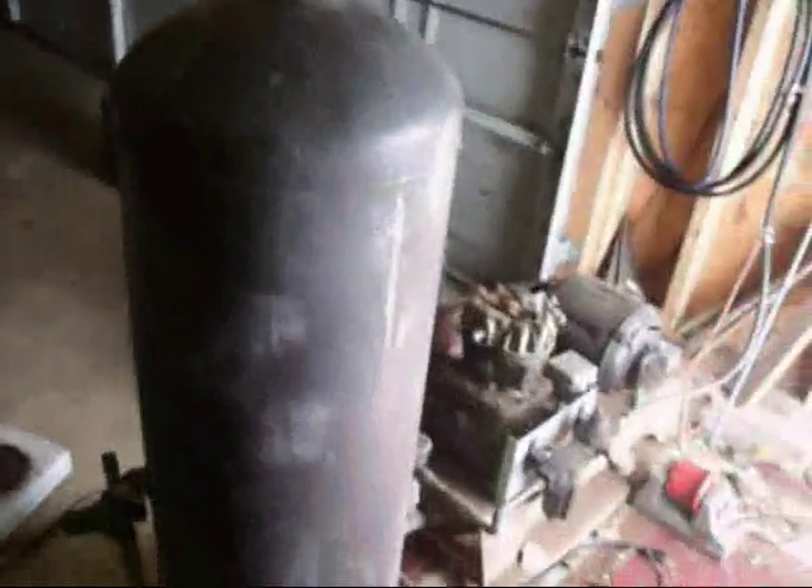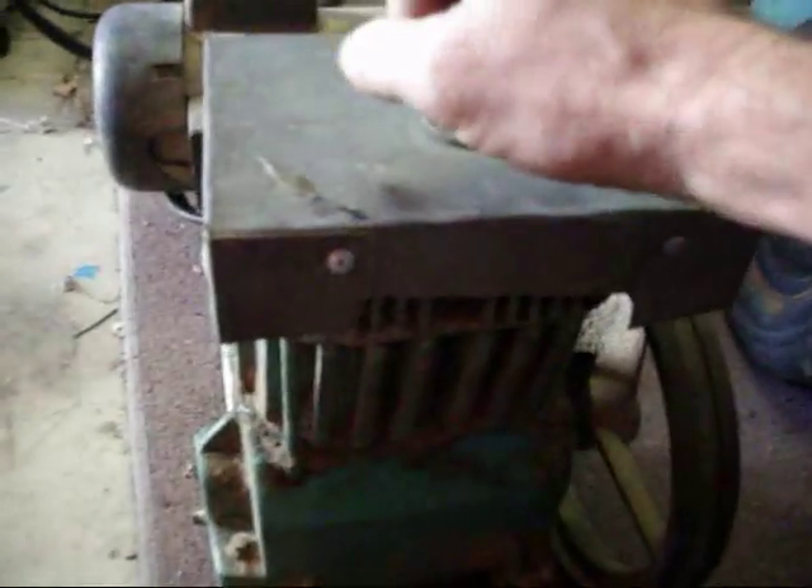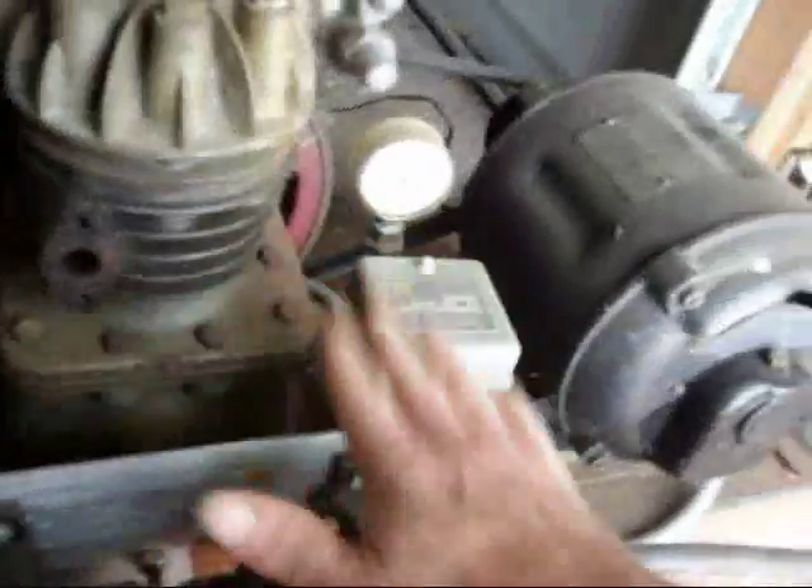Because I can get the big tanks — like this one on this air compressor. I got a really good deal on this right here. This tank is like one of those 100-pound propane tanks, converted. And that compressor works — it came together and it was like $35, I couldn't beat that. But this doesn't have the right intake on it so it's not going to work. The intake is just a big wide area with a foam piece — it just sucks air in from outside and I can't restrict that. The whole idea of compressing the charcoal gas is that I can't mix it with oxygen because then it becomes explosive, so I need to pipe it directly from the gasifier. And this is the compressor I use in the shop — I'm not tearing this one down.